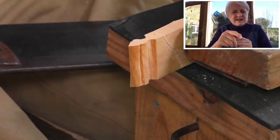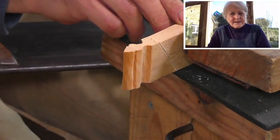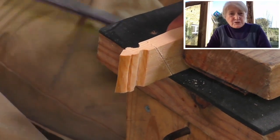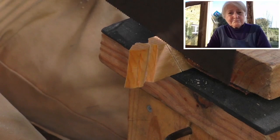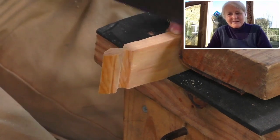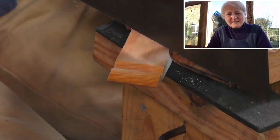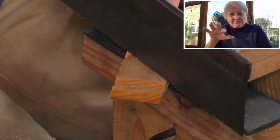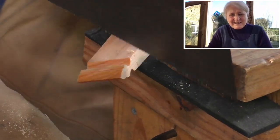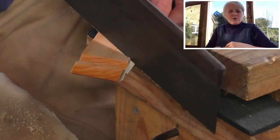The cutter side's got to be right opposite. You need to mark it with a knife or something. I use the saw, but when I first started I used pencil. Pencils are for wusses — which you most definitely are not! You can do a certain amount of adjusting if you don't get it dead straight, but it's much better if you can. The saw wants to slide down this corner — it goes all over the place.